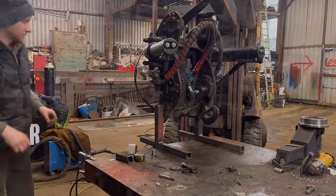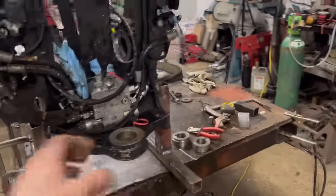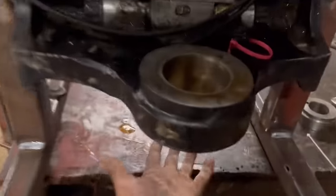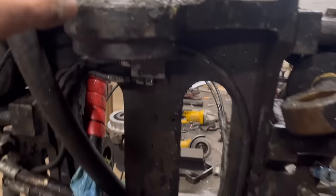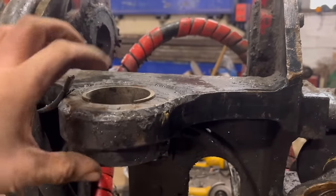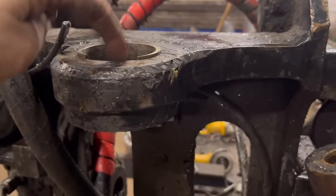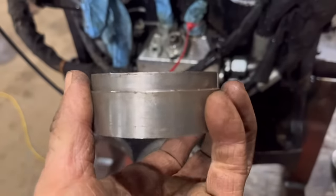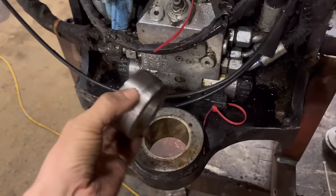That's that sat on the bench, nice and solid, clamped on there, legs are welded on, so I've got plenty of space under there to put a bearing on for the line boring. And then this top one is the one that needs welding. So I'll knock them bushes out now, see how badly worn the hole is. And then I do have these already made. That bit there is 70mm, so they should fit in there. And I can use them to line up the bar, hopefully.